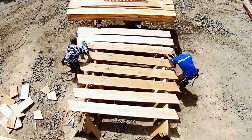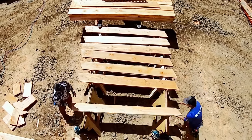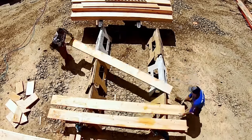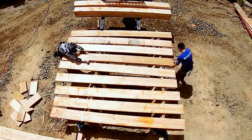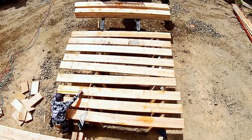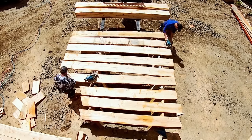It's not difficult. Now, I will say this, we often cheat. We've already built our rake walls, so instead of doing the math again, we're actually gonna just measure the rake wall. And that's one way. Let's just say that you did make a slight mistake in your rake wall. You can fix it easily by just changing the rafter length somewhat. So don't tell anybody, but we don't do everything perfectly.